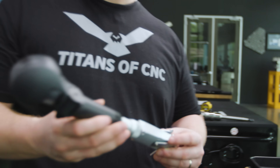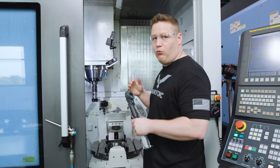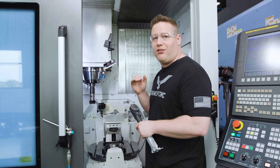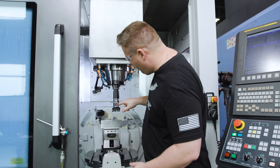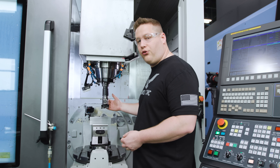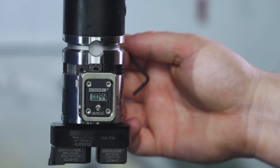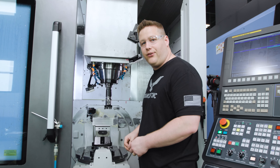We've run it a second time and we're going to check it again and see where we're at. We're at 2.7405 — we overcut by half a thou. There are several reasons for that, and one of the main ones is tool pressure: the first cut may not have cut the exact amount of material that the second cut did. That's why I always like to do at least two finish passes. So we're going to adjust the tool by nine and a half thou right to our finish size. One cool thing about this digital display is when we pop it back on and turn it on, the amount of adjustment from the first time is still there — it stays until you clear it. We press the on button again to clear it, loosen our locking screw, and adjust nine thou and five tenths. I've moved it nine and four tenths because I anticipate when I tighten the screw it'll move a little bit — and we're at nine and a half. Good to go. Now let's take our final pass.